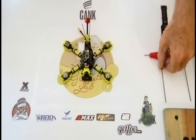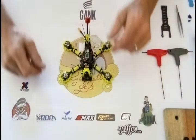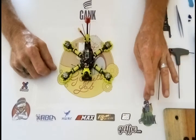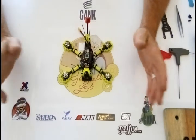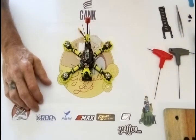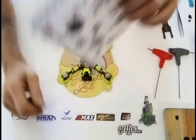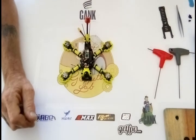But I just wanted to let you know that even though you make changes in Betaflight, save and reboot, they do not always take effect on the flight controller or the VTX. So if you ever have the chance, go through the OSD using the stick method, direct route, get the proper LED readout along the sides. If you need to find that, I don't do much business through Banggood anymore, but Banggood actually has a decent manual with all the work-throughs and the LED meanings and everything else, whereas Rush only gives you a wiring diagram and nothing else. Great product. I just wish for some of the newer people it was a little more self-explanatory.